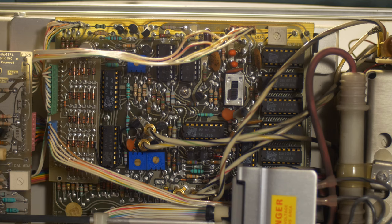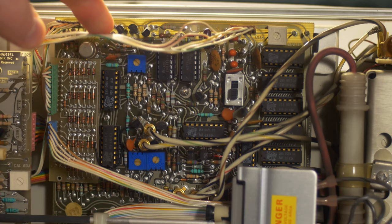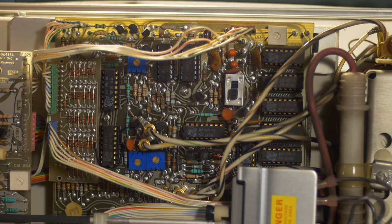So you can actually see this readout PCB as an example, but every PCB is like this. What is actually interesting is that you can see all the custom Tektronix ICs. But what you see, which is interesting, is that everything is socketed. Look at those. All the ICs are socketed, but also the transistors are socketed. There's a little PCB with little holes that are soldered on the PCB, but the actual transistor itself is not soldered, it's just socketed. It's a great thing for servicing, that's for sure. But over time, those contacts usually don't, but sometimes they could go bad. So yeah, that's a thing.